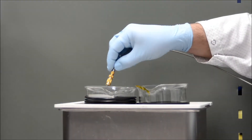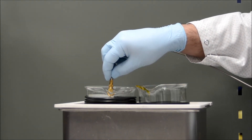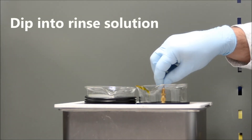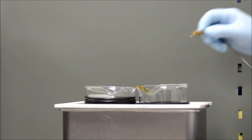To clean the connector end, dip a few millimeters of the connector ferrule tip into the isopropyl alcohol beaker and activate the ultrasonic cleaner for about one minute. Switch the connector to the deionized water beaker without delay before the isopropyl alcohol can evaporate. Leave the connector soaking for about one minute.